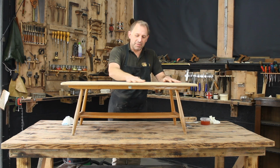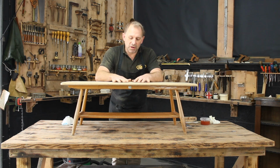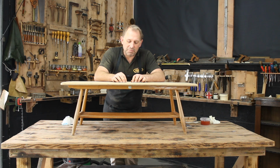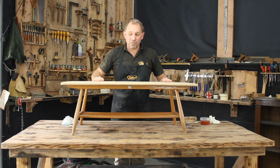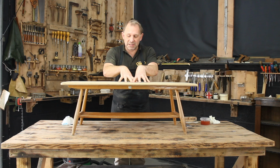One point I must make was why we neutralise after sanding and not before sanding, because if you were to put a neutralising solution onto the surface straight after you use the wire wool, especially when you're using it on oak, you can get a reaction with the wire wool and the methylated spirits and the timber beneath, and it burns. It leaves little black marks, little iron oxide marks from the wire wool. So I always neutralise after I've sanded. So you initially sand, then neutralise, leave it, then sand again, and you've got a lovely prepared surface here, ready now for finishing.